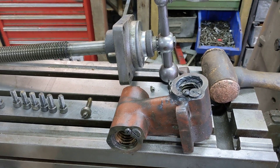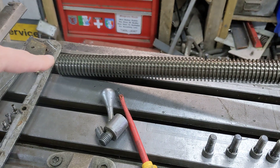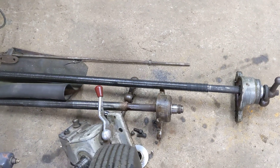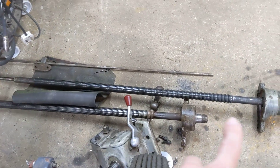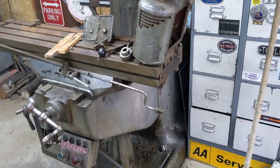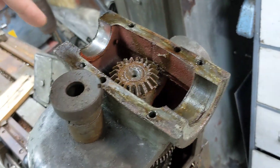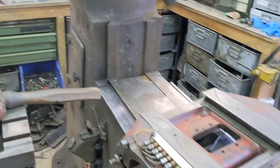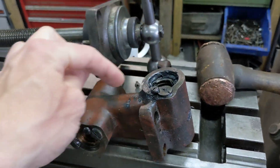What I'm able to do is buy a couple of ball nuts and matching screws and fit them into this carrier without pulling my Bridgeport apart, which is excellent. I can get everything sorted and work out the distances that the screws need to go. This end is floating in the Y-axis. In the X-axis it's a little bit more complex - there are two screws on the floor there, obviously there's a bearing carrier at each end. We've got two different Bridgeports here - one's got one type of power feed at one end, which is the same as mine, so I'm expecting I've got this type of bearing holder. The other Bridgeport's a little bit older with a different type of power feed.